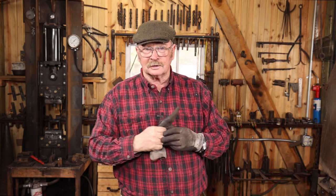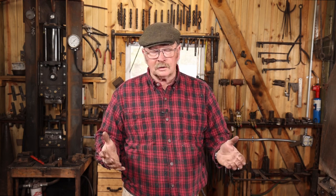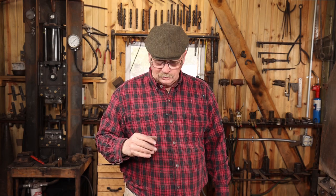When I'm working on something that's close to finished — it's already been hardened and tempered and I don't want to overheat it — I'll usually take these gloves off so that my fingers can feel the heat before I've caused damage to the project. Anyway, that's just my thought on wearing gloves in the blacksmith shop. It's entirely up to you and your shop what you do. If you feel like gloves make you safer, or if you're working somewhere where there are regulations that require you to wear gloves, well, that's the world you work in. But in my world, I'm constantly doing a risk-benefit analysis — is the risk greater than the benefit, or is the benefit greater than the risk? And I decide based on the situation when I'm going to wear gloves.